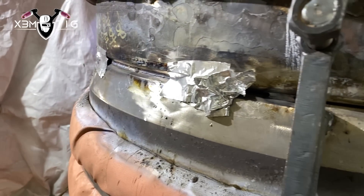Ideally I prefer a little bigger gap, especially on this size pipe — as the gap shrinks on any pipe, 5/32 would be ideal for this. I change techniques depending on the gap — laying wire or dipping, it all depends. As you can see here, I'm keeping the rod on the edge almost 50/50 on the bevel edge. That's why I'm using 140 amps, just to push the puddle inside. A good strong purge is going to keep that nice and uniform.